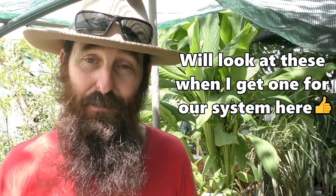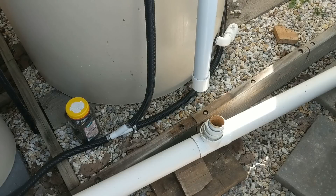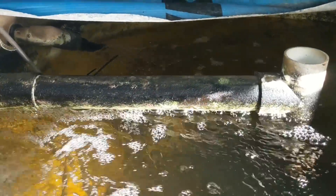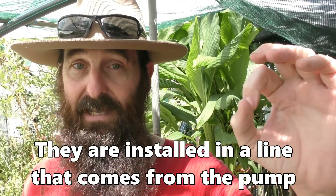There are some other backups you may be interested in checking out. There are in-line flow switches, which come in handy when you have a circumstance like we did the other week where a pipe fell off the fish tank — one of the drains — and it allowed all the water to be pumped out of the sump tank. The electricity was still flowing fine so luckily my other compressors were providing air to the fish. If I was running with just a Venturi though, I could have ended up with dead fish, so an in-line flow switch would have come into play at that point.